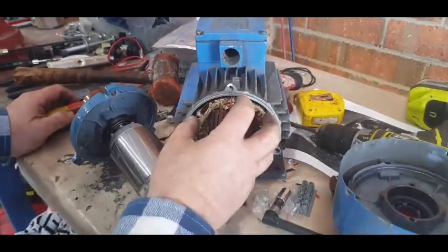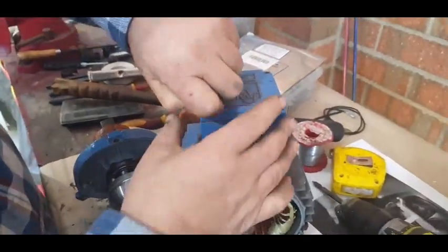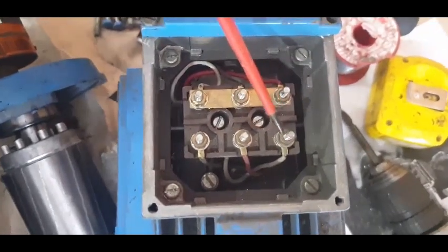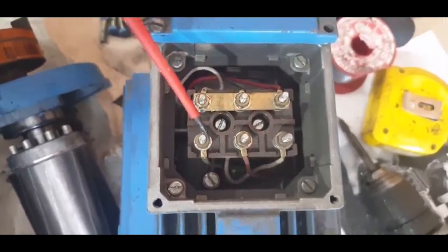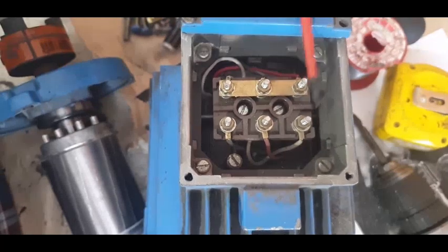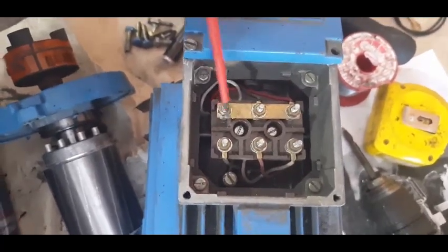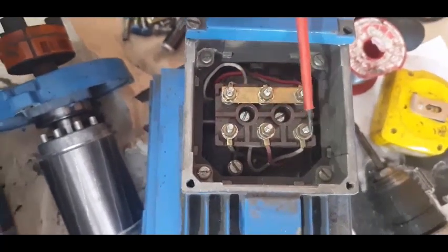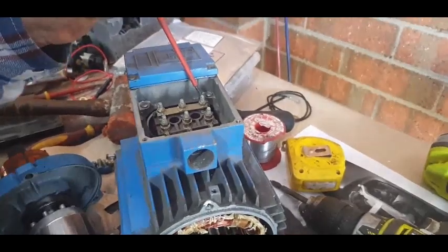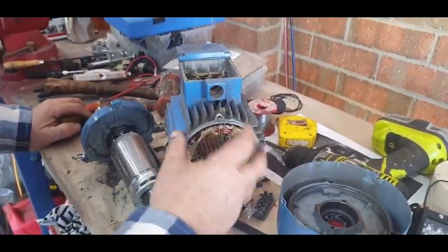Now look at the winding wire on these — there are three windings in here, and they all consist of equal values. Red, white, blue — three phases — and you have six windings. This is wired in star. One winding comes in and goes down, the next one comes across here. Anytime you come into the winding at the star point, you actually have two in series — this is star. If we were going to do it in a delta configuration, we would have three bars facing across, meaning only one winding between two phases. In star we have two windings in series. This is my star point — we don't need a neutral because all three windings are equal, say three ohms each. The current basically cancels itself out, like two negative fives and a positive ten cancelling to zero.